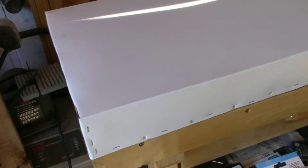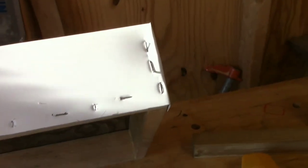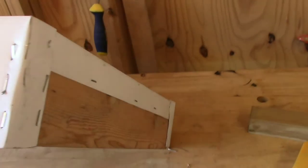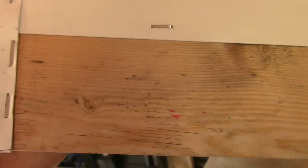Here we have the finished top. It might not win any beauty awards, but my concern is that the staples I'm using are going to rust — aluminum of course is not going to rust — so I hope it doesn't streak too bad. I may throw a little layer of paint on those staples just to be safe. You can see it's just a simple lap on the edges. I might throw a little paint on the ends that didn't get covered, but that's the limitation of the stock I'm working with. Hopefully the next one will turn out a little better, but it's a nice sun-reflective top. I'll probably weigh it down with a brick or a block to hold it on, but they look pretty good when they're new.